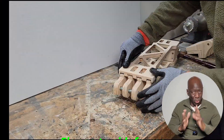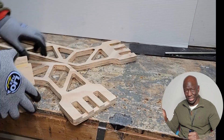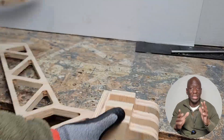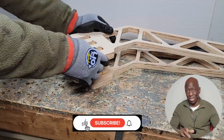Remember that three-quarters-thick is actually 23 over 32, which is approximately 0.718. I made the press fit slots to 0.720, which actually in some cases required a little bit of sanding to fit.